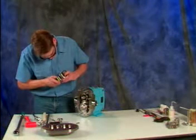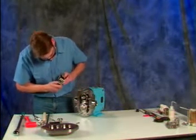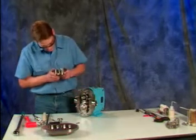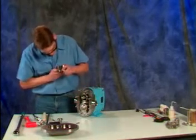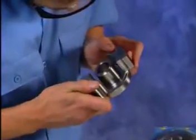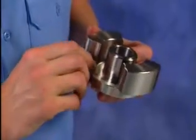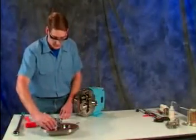Check the rotor wings for indications of metal-to-metal contact. If this condition exists, they may need to be buffed or replaced. Generally, this contact is caused by a twisted shaft, by loose, worn, or mistimed gears, or by loose rotor nuts. Also, check for stress cracks on the rotor wings, which can be caused by excessive discharge pressures.